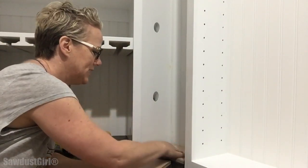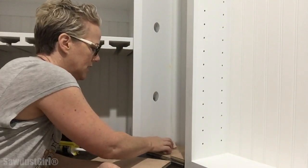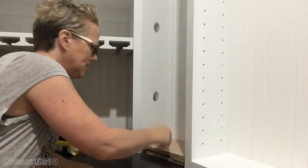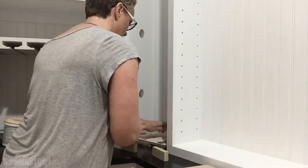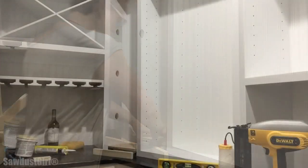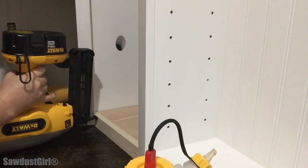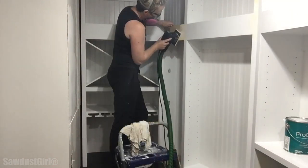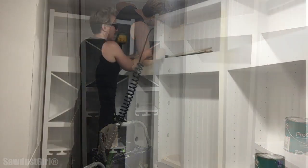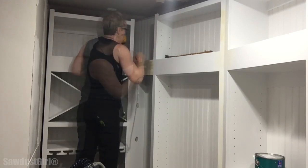This is going to be really ugly underneath — if anyone ever pulls this apart and looks at it, it's going to be ridiculous. But I think that if I double that up, it will raise this to where it needs to be. I nail the bottom face frame onto the shelf and a face frame onto the middle shelf as well, then putty and sand. Basically I'm just holding this whole thing together with caulk, cleats, nails, some glue, and cutting little scraps and shoving them in place.